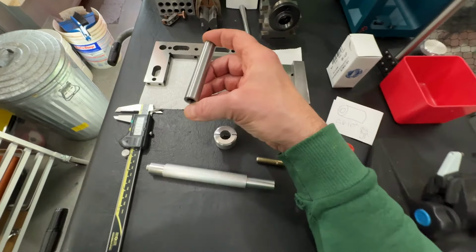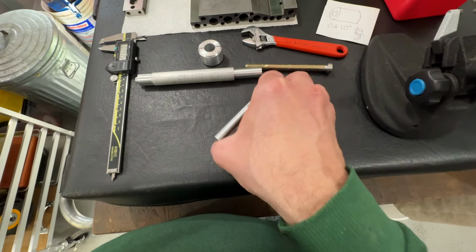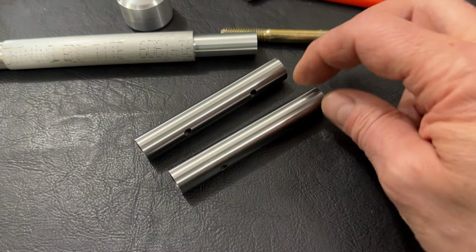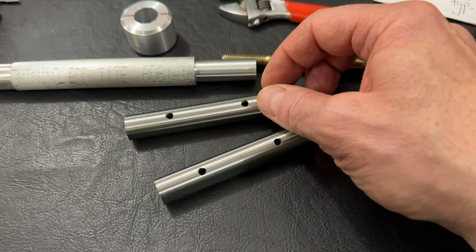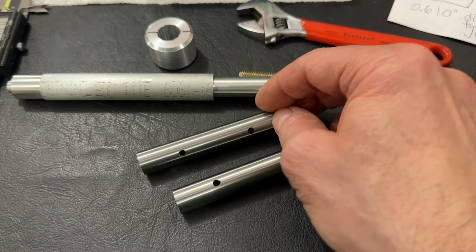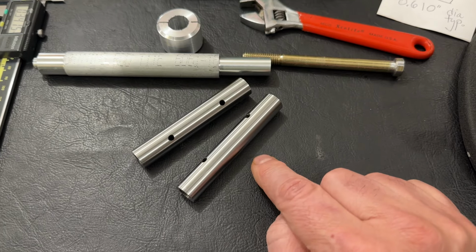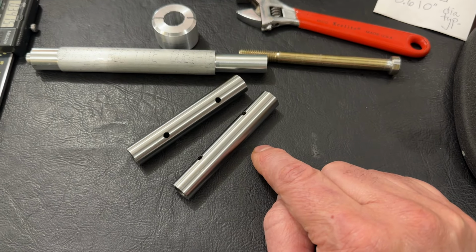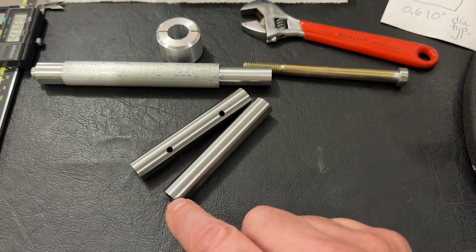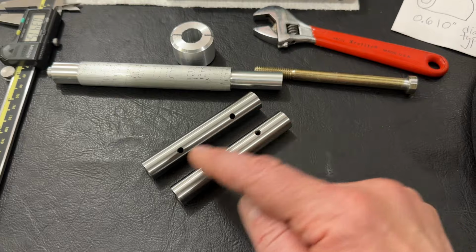Keep in mind that these dimensions between these two rolls need to be equal. They do not need to be any specific value. Right now, the diameter of these rolls over all their lengths is within about plus or minus a tenth, maybe a little more. All we're doing is bringing that in to 0.0, and we'll take some readings and show you what we're up against.